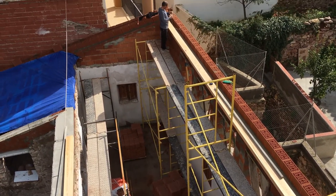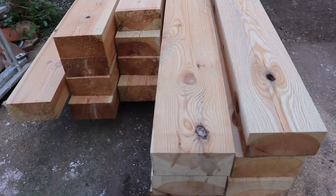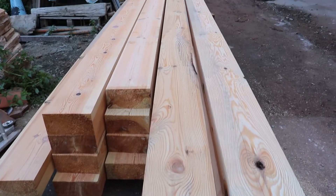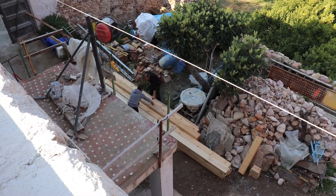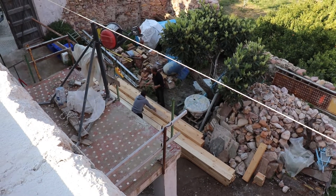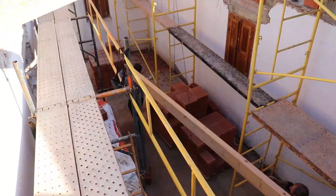The walls have all been finished now and the roof is ready to go on. The first thing are the Scots pine beams — they're called Pino del Norte here, though I'm not sure they're from that far north. The beams have to be cut to size off-site, untreated, then given an anti-woodworm and fungus treatment, and then lifted into position.